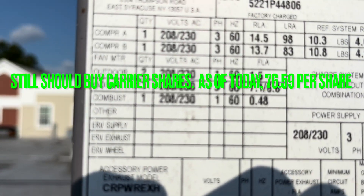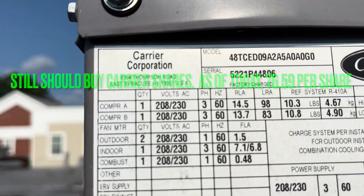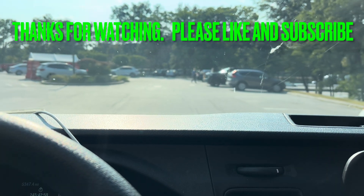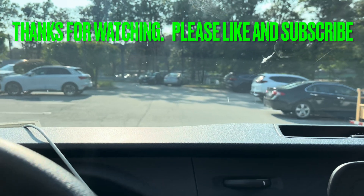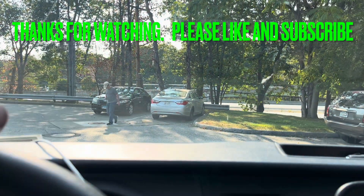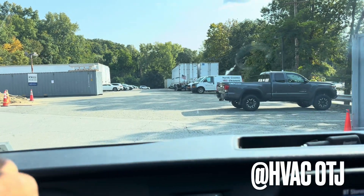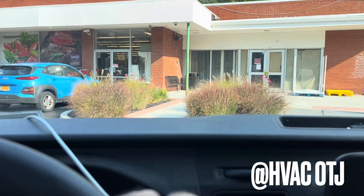It's indoor, three-phase — three phase right there. Thank you for watching, please like and subscribe. Have a great weekend. Simple — not always simple, but simple RIB relay bypassing so you can call for G and cut your common and energy on and off instead of running constantly, especially in a commercial application. Have a great weekend, take it easy, thank you, take care.